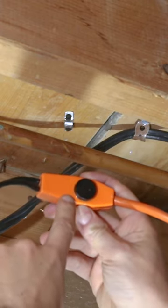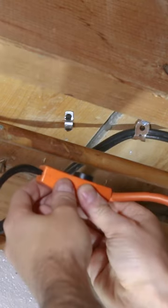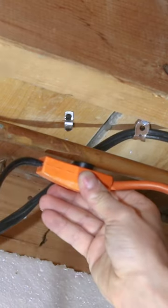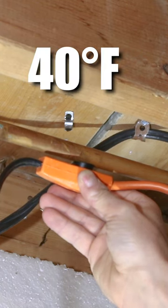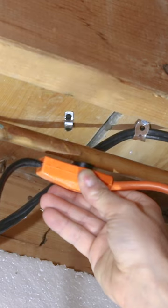The way it works is that the wire has a thermostat on it which needs to be in contact with the pipe as such, and turns on as soon as the pipe reaches 40 degrees Fahrenheit or 4 degrees Celsius to prevent it from going below freezing temperature.